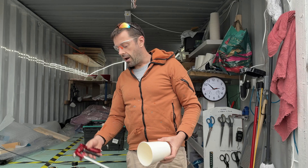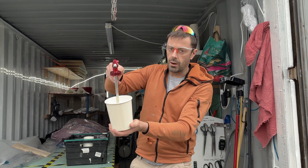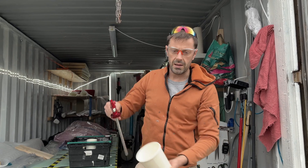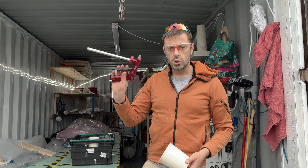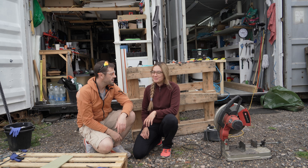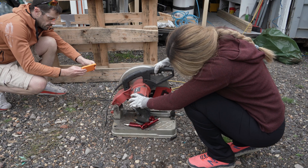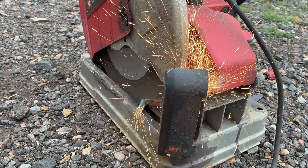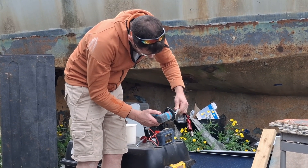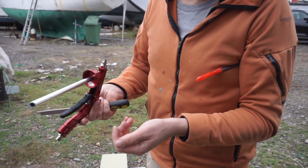Let's turn to my resin spray apparatus. The reason why we're shortening these slightly is so that when we are angling them down we're not going to end up spilling resin out of the cup that's being angled over too far. If it's set down a little bit lower then we'll be able to angle it down in the spraying booth and keep the resin in the pot but still get the angle that we need. I got three of these really cheap wide nozzle compressed air sprayer heads and we need to adjust the feed pipe as it's too long. They're designed for single use tubes or pots of screw-on car under spray or grease or other delightful gloopy things. The sharp ends are now offensive weapons but we can sort that out with a mini flap wheel and then finish off with a manual flap file since my round one has gone AWOL.